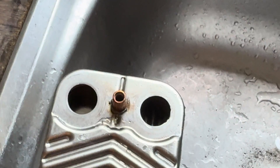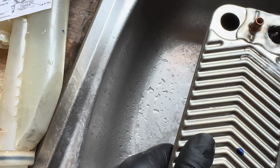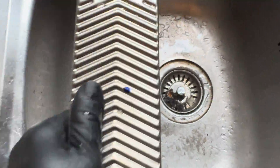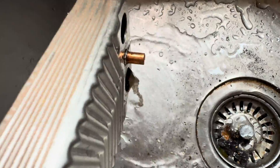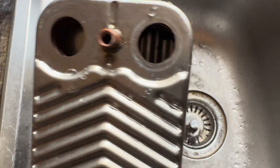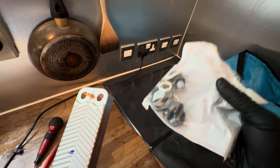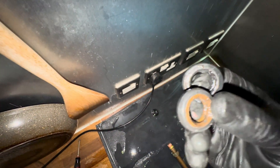I have got a new one here — I just want to see what's in this one and how bad it is. Give it a little bang, run some water through it, shake it out and see what deposits are in there. Sometimes you get quite a lot of big flakes coming out; sometimes you've just got little flecks like this, which you wouldn't think would cause a problem, but they do — there are tiny little waterways in here. The way this works is it's a plate-to-plate exchanger: you've got plates on top of each other going hot, cold, hot, cold. If they get blocked up, the hot ones retain their heat and make the boiler overheat, but where the cold mains water is coming through so quickly it cools it down rapidly — and then you get that fluctuation of water temperature.